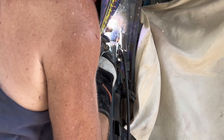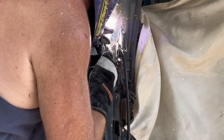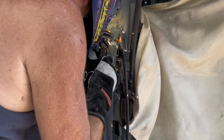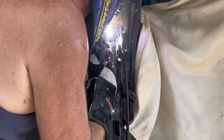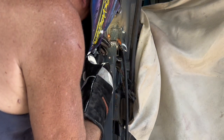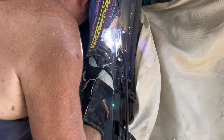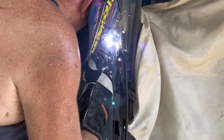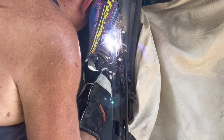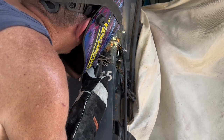You can probably tell by all the talking I do in these welding videos that I love to weld. I'm thankful that welding produces its own light so I can see what I'm doing when welding. I can't see to get started — that's why I put my hat light on the welding helmet. Other people can see through their auto-darkening lens and see the gap they're welding; I have to have light shining on where I'm going to start. I can't start the arc and then find the right place — I can only see the area where the arc is and the puddle right at the edge of the gap.